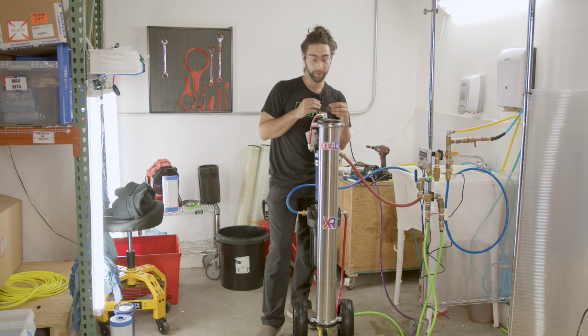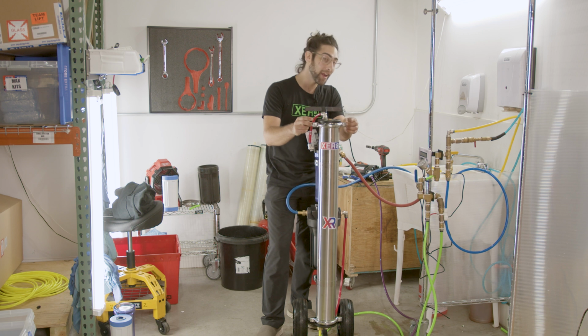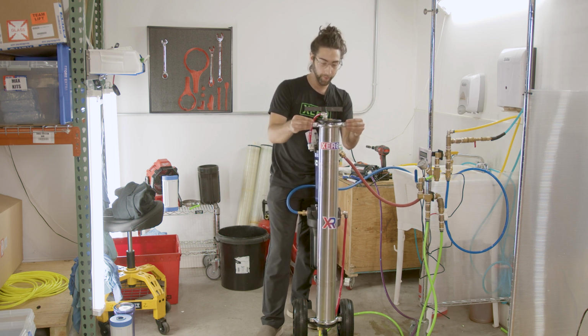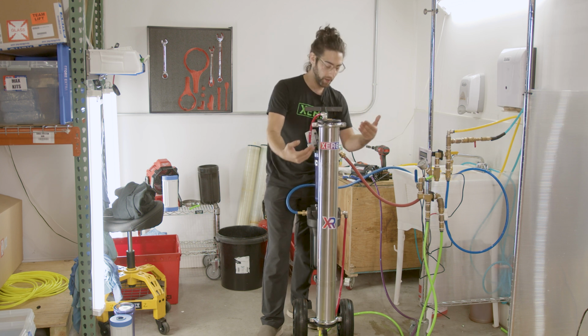Now we're going to measure to see how well the membrane is performing. Now, the membrane is going to take out about 90%, 99% in some cases, of minerals in the water. It's highly dependent. You want to change this when it reaches 80%. How do we figure that? You'll take your source number. Mine was 81. We're going to see what we're getting out of this.